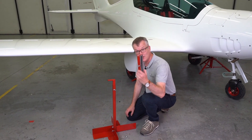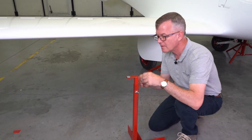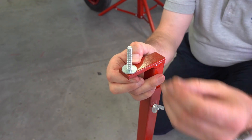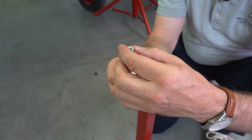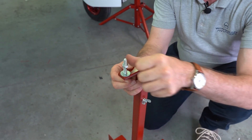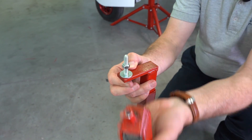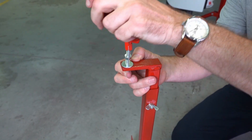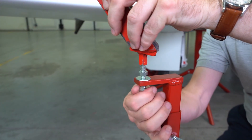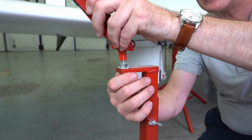To assemble the tail holder, place the washer on top and run the bolt up from underneath. Now run this nut down by about 20 millimeters, same as before. Then introduce the holding device and run that up about 10 millimeters into the arrangement.